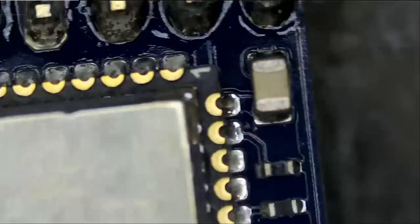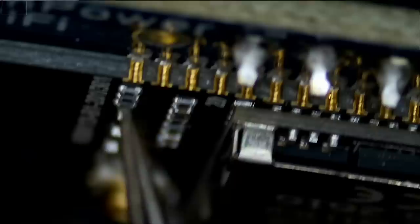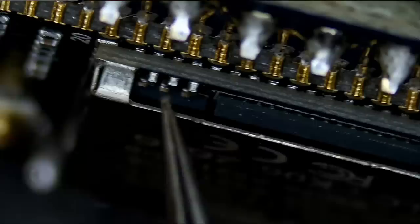All right. And if we take a look at the motherboard, the chip is soldered on like this. Right now, it looks like the Wi-Fi module is made out of two layers. We have a BGA layer that's soldered onto the Wi-Fi module, which is soldered onto the board. So it's a little bit risky applying heat from the top because we may end up tampering with the solder balls or with the top layer. And if we apply heat from the bottom, we have plastic. So we may have to use our soldering iron along with hot air, and we have to be careful.